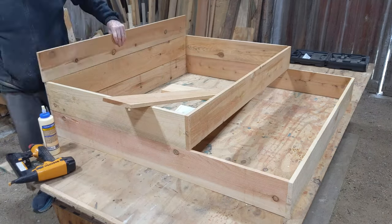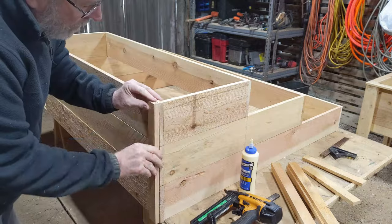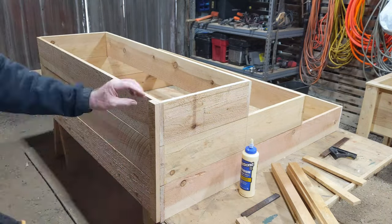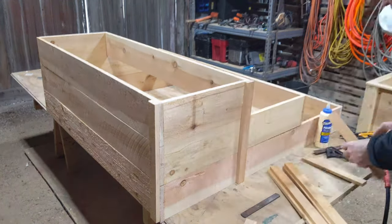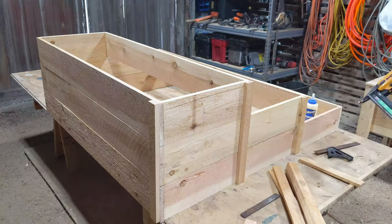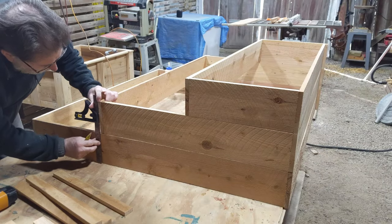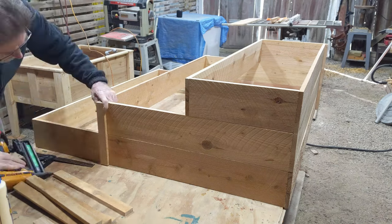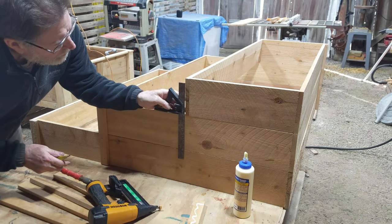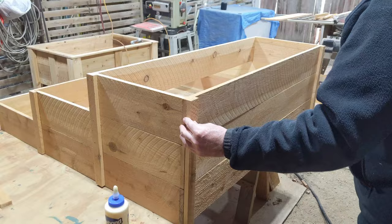I stacked the boxes on top of each other as I was building them and lined up the edges. Steps four, five, and six are putting on the side and back trim pieces. These pieces hold the boxes together and each piece is glued and stapled — I switched to one inch staples here to make sure no staples penetrate to the other side. When putting the side trim on the steps I placed a straight edge against the front of the tread and marked a line straight down for a nailing guide. I repeated that same process for each tread. The back corner pieces go on before the last two side trim pieces to hide the butt joint from the side profile view.